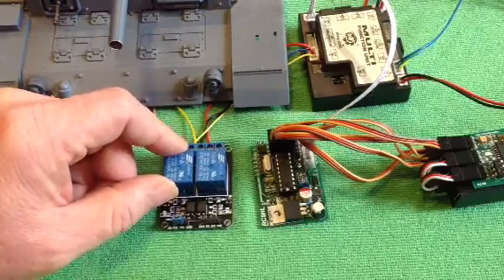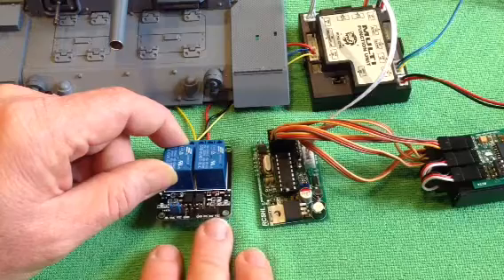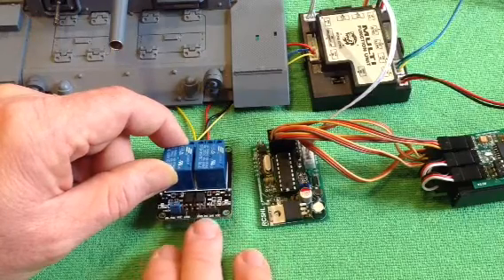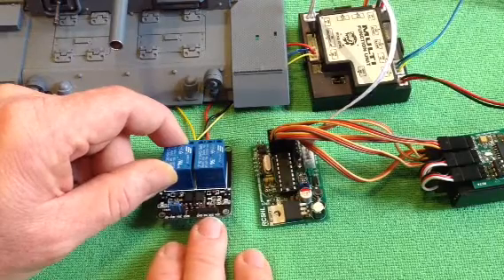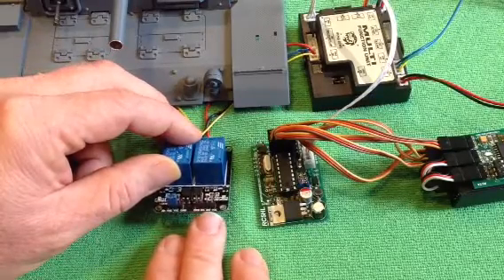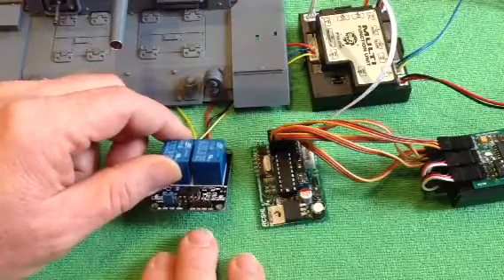They will have a number of pins on them — these are your input pins here. They will have a voltage pin, a ground pin, so your plus and minus supply, and then a number of extra pins depending on how many relays you've got. I've got two relays so I've got two additional pins because I need to trigger relay 1 and relay 2. If you buy the single board it'll just have three pins across there.